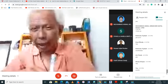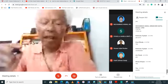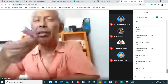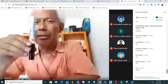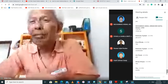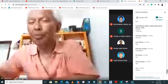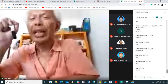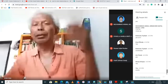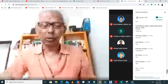So, Q out equal to F sub S multiplied by A sub S plus A sub T multiplied by Q sub U. Okay? Equation one is for a cylindrical shape. The tip is circular, and the shaft is cylindrical like this. Why do I say this? Because that A sub S is a function of the shape of the pile. If I don't say it to you, people take this formula as the overriding formula, even when it is a square. So that cannot be right. I assume that when I wrote this formula, because I've already explained the different shapes of the piles and everything, you'll be smart enough and intelligent enough to make the difference, right?